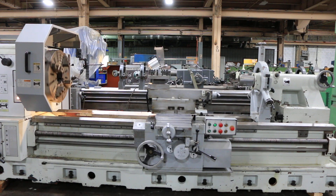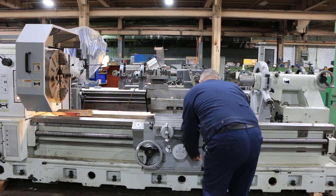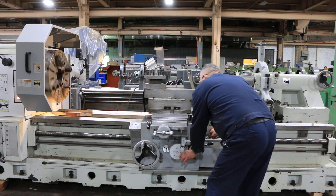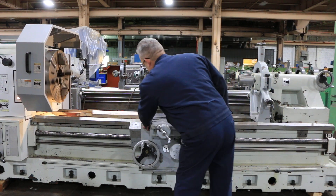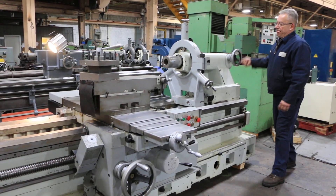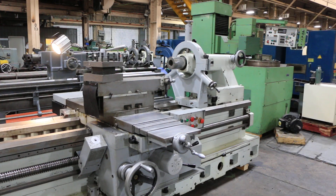You've seen it thread, you've seen it feed, and you've seen all different spindle speeds. Last but not least, we're going to rapid — rapid longitudinal both ways, rapid cross both ways. So you've seen rapid, feed, and thread at all different spindle speeds, even rapid at the top end. We also have the tailstock quill — a heavy duty tailstock with a number 6 Morse taper and about 9.84 inches of travel. Very nice condition. I think you've seen it all. Thank you for watching our video.